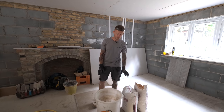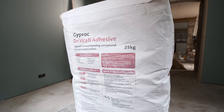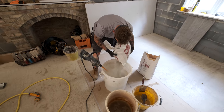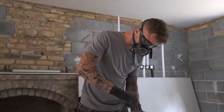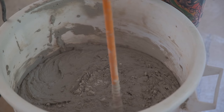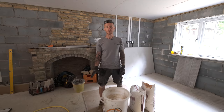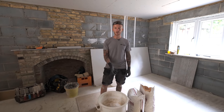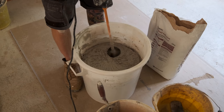Check the back of the bag to see exactly how much water the manufacturers recommend you use with the powder. Make sure you mix in a well-ventilated area, wear a mask wherever possible, and use a mechanical whisk. Mix the absolute minimum that you need to — get rid of all the lumps and then stop mixing, because over-mixing can cause adverse setting times.